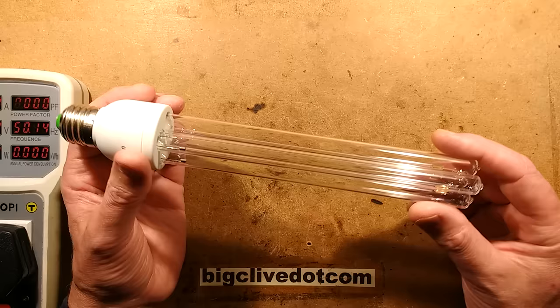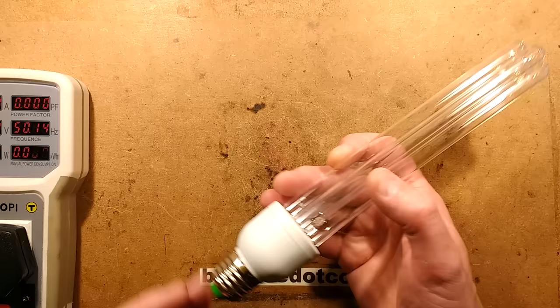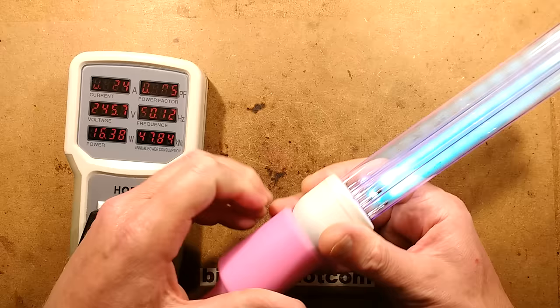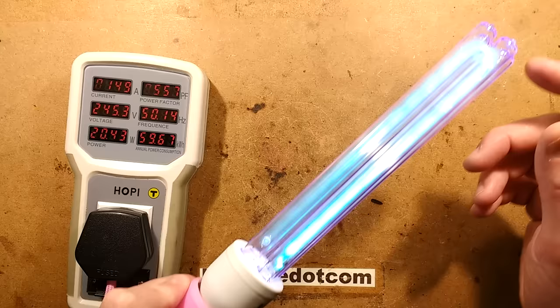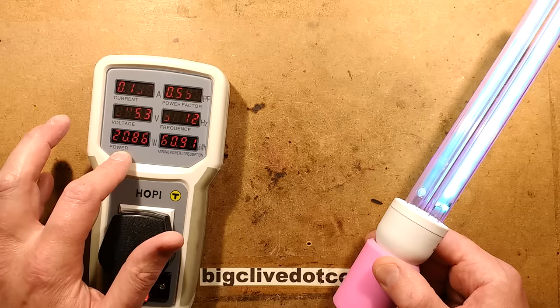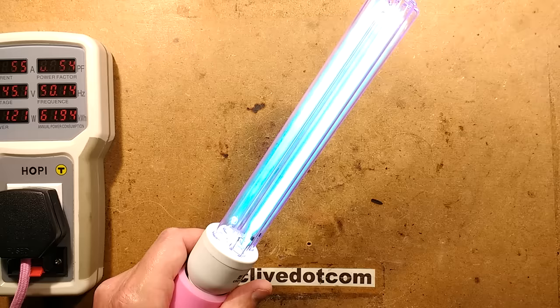Because this is an ultraviolet lamp. It puts out UVC, which is very shortwave ultraviolet, through the special glass, and it sterilizes rooms. I'm going to plug it in very briefly — I'm not going to spend too long gazing at this blue wonder. Here's the flickery hoppy meter for analysis. It lights up this delightful blue — that is real, that's what it looks like. It's fantastic in a bad way. I can smell the ozone already. 150 milliamps at 245 volts and 21 watts of power, 0.56 power factor. I can feel it — the back of my hand now smells of burnt pork. That's bad. Let's unplug this.